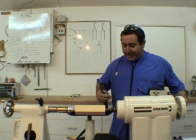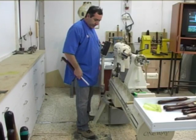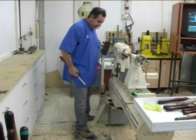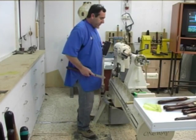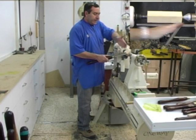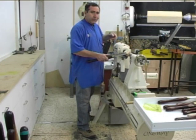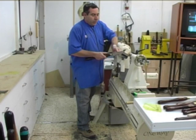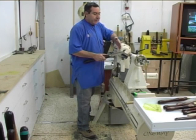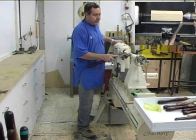Okay, now you can see how I stand next to the lathe. First, look at my feet. Right leg is 45 degrees, left leg is 90 degrees, okay? Now the tool, if you compare the spindle and the tool, it's 45 degrees, you can see these are 90, and these are 45. The tool on the tool rest also is not 90 degrees, it's 45 degrees. Okay? Then I'm going to cut now from this corner, close to the revolving center,